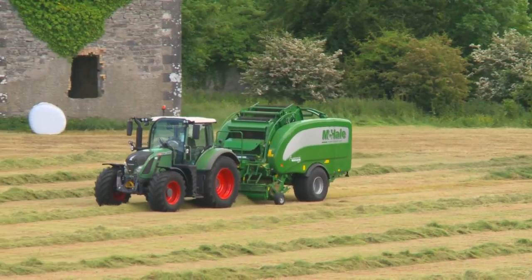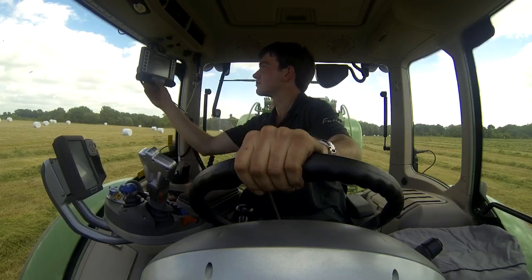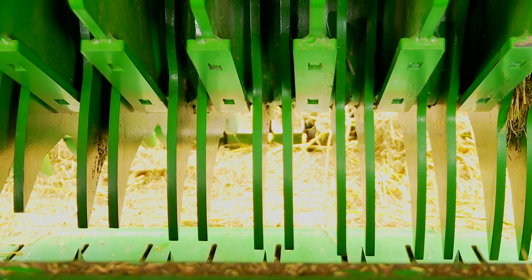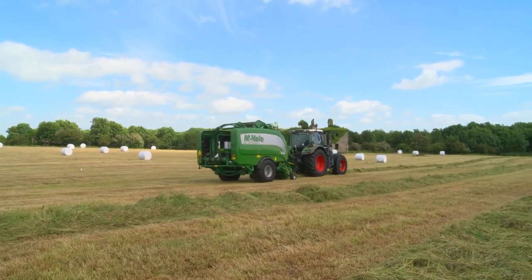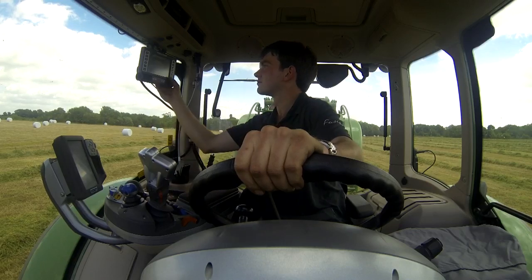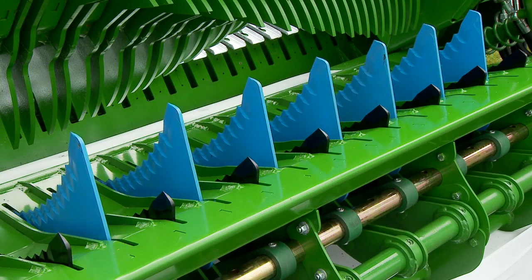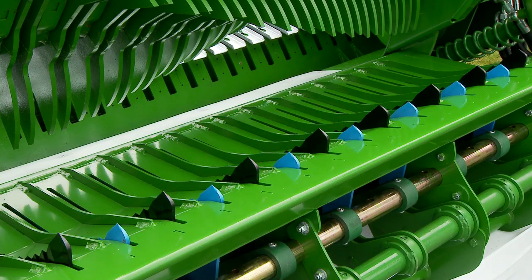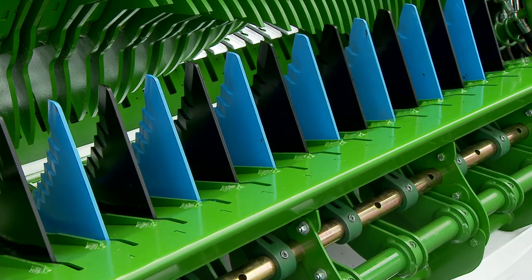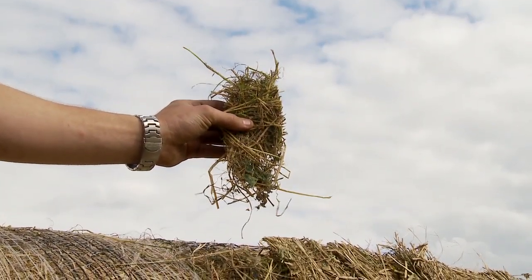On the Fusion Vario, the knives can be raised and lowered from the tractor cab, allowing the machine to make chopped or unchopped bales in line with the operator's preference. The operator has the option to upgrade the chopper unit to a selectable knife system which provides three options: engage and chop with a bank of seven knives or with a bank of eight knives. Should fine chopping be required, the operator can choose to engage both knife banks, which will give a 15-knife chopper system capable of delivering a chop length of approximately 65 mm.